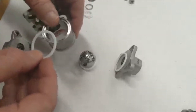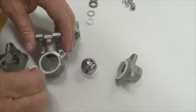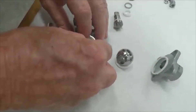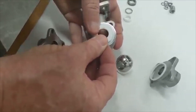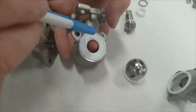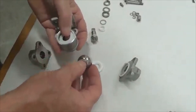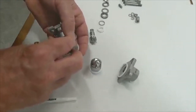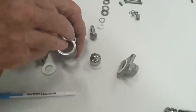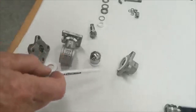There are two seats at the end: an outer seat that seals between the body and the end component, and an inner seat which is the main body seat for the ball. The seat can float backwards and forwards. There are four little V-ports around there to equalize the pressure between the body cavity on the inside and the actual supply pressure coming in. When the ball is seated, pressure builds up and decreases, and the seat can slide in and out — the pressure is differentiated between the two, which is an important component.